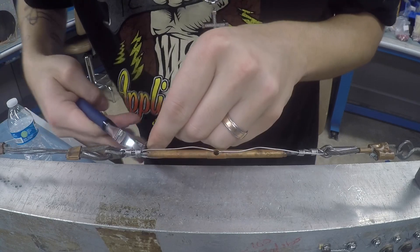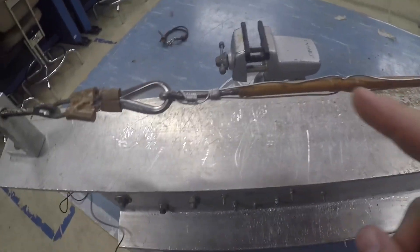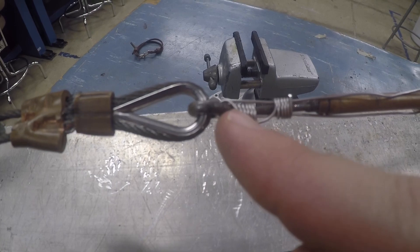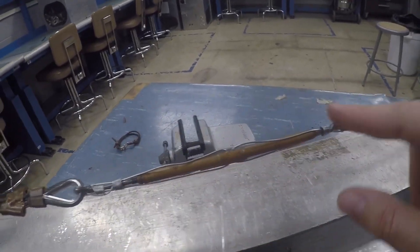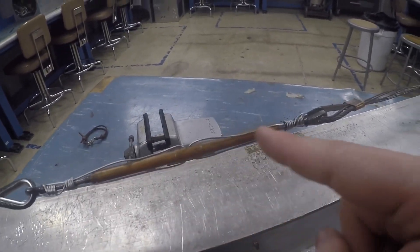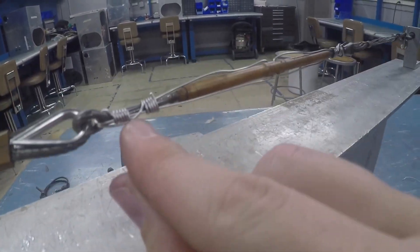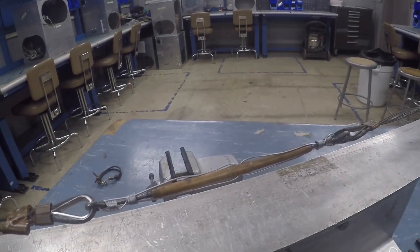Here are my tips for both of these — I'm going to pull the camera off the stand and get you nice and close. When you do this, try not to put this piece of wire directly over this wire. Don't start your wraps here for this one, and always remember to go the opposite direction on each side. A little trick: if you want to make it look cleaner, you can put both pieces of wire through the eyelet initially and bring them both this way. That way, this piece of wire will actually be underneath these wraps.